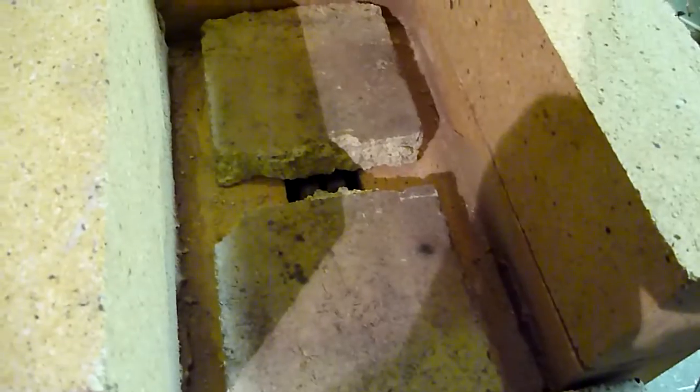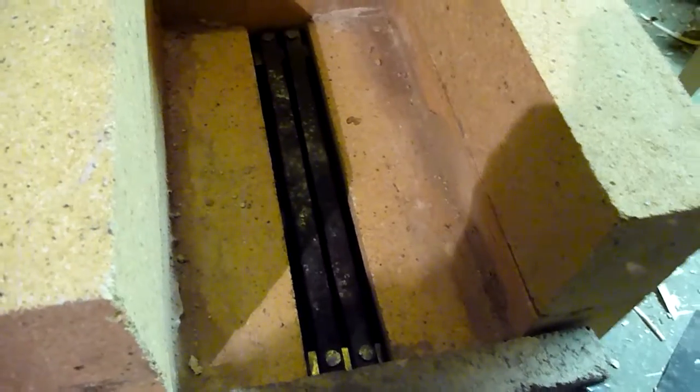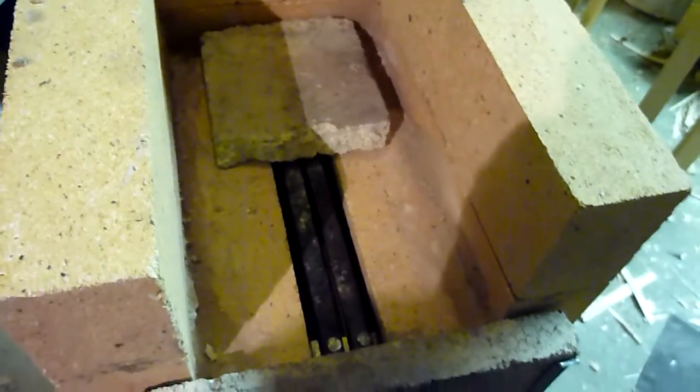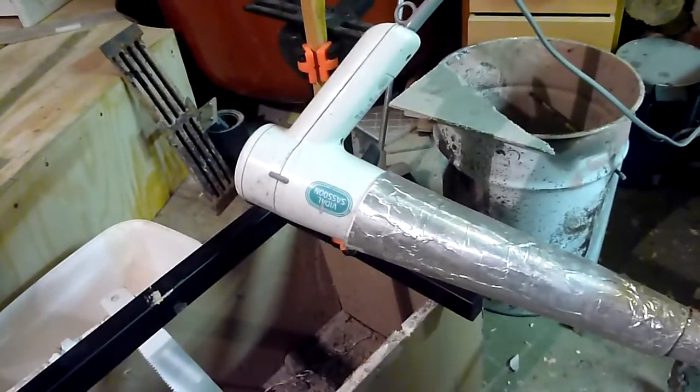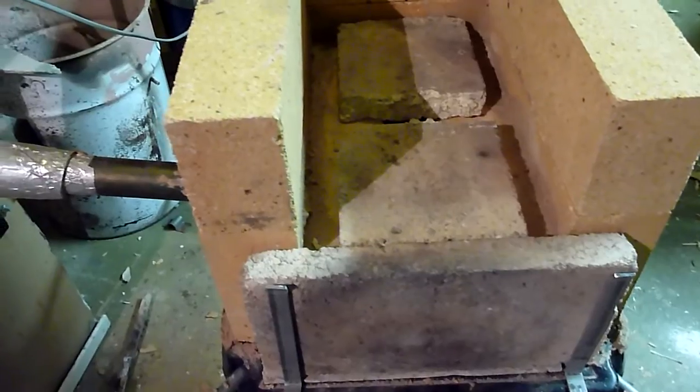Another thing is here is the same brick but cut in half, which can cover the air intake vent. So I can limit where the air blows in, which means I can control where the highest heat is going to be. For heat treating, I'll probably remove this. If I remove two of these, I get a really long, nice working area — this is 30cm plus length and depth in here, which should be enough for most of the work I'm gonna do. And as you can see, my blower is an old hair dryer. So far that has been working great, and I'm quite confident it's gonna work on this one as well.